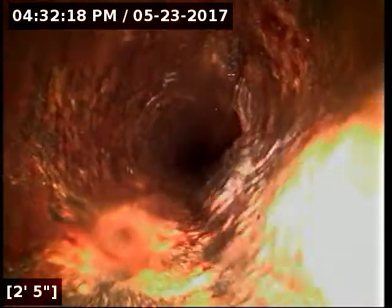We currently have water running. It's a long drop down into here. I'm going to try and zero out right here, I believe this is the base of the vent. Or I'll zero out right here. This is where the vent ties into the main line anyway. Transitions over to 4-inch concrete here about 15 feet out.